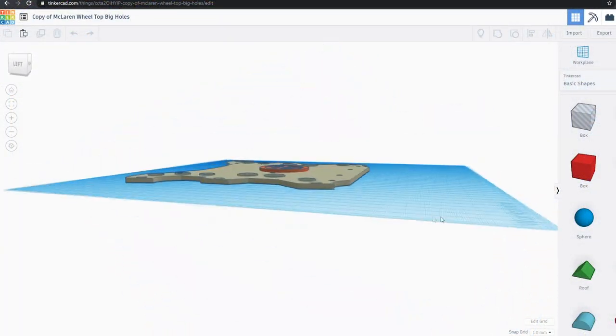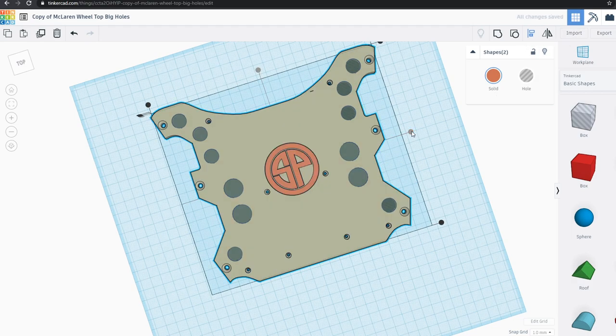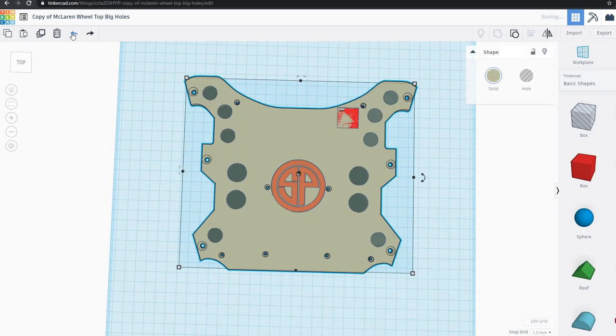With these new internals, new shaped buttons and encoders, I had to go back to redesigning or altering the Fox 85 design. For that I used TinkerCAD, an online web-based generic CAD drawing program. This included larger holes for the buttons, slightly changed button spacing due to their size, and the encoders had a larger internal dimension and had to be completely relocated to a new spot more in the middle of the wheel. Three reprints later we got it close enough to start assembling.